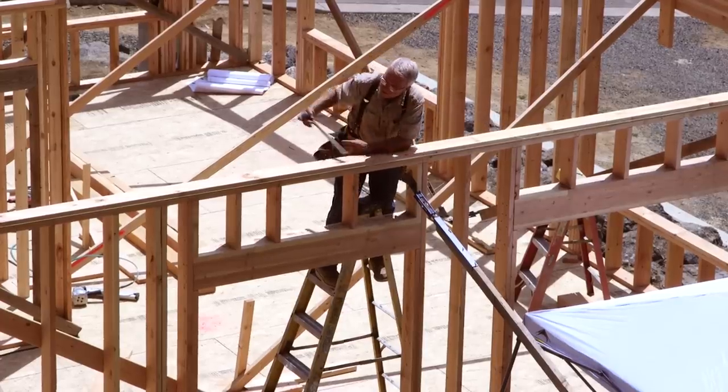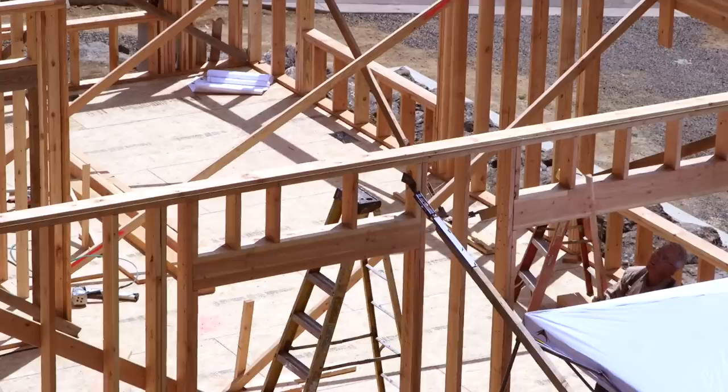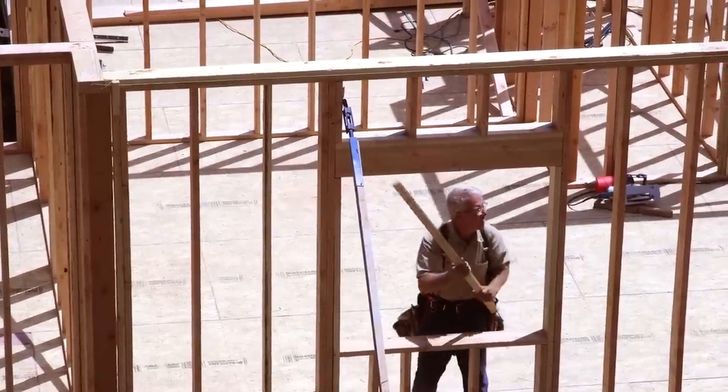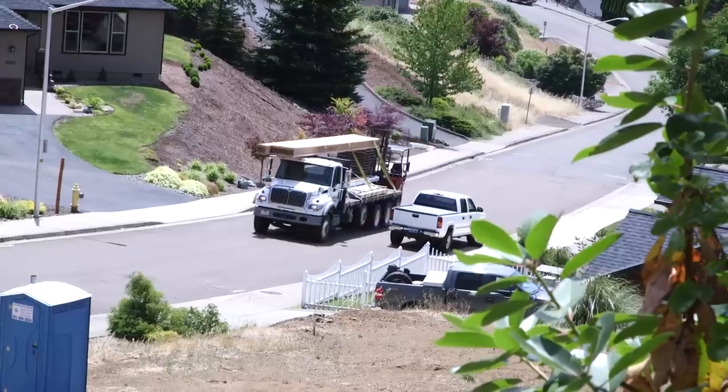Even though each board was the right length, just the slight deviations in the actual texture of the cut increase the distance as the boards and the components come together. So watch for the small incremental gains or losses that can add up to a real frustration at plumb and line time.